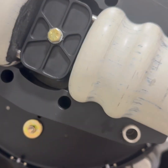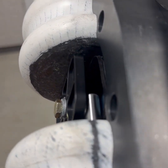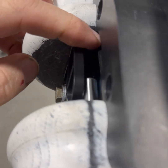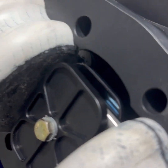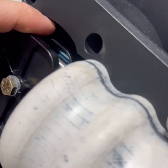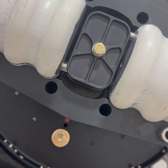We've got this bolt here that actually holds the prop pins — hard to show, but it kind of captures them anyway. And that's what holds this pitch. What we got is a whole bunch of a stack of shims back here in front of this pitch block. I'll show you that as I take it apart, and then we're going to add this new shim into the back behind this pitch block.